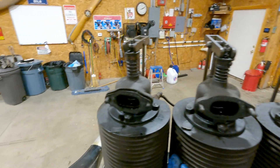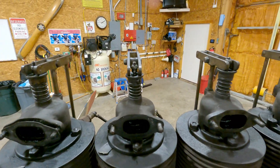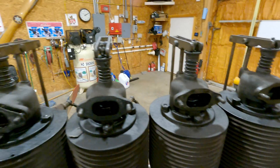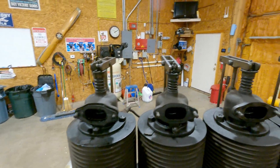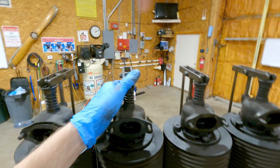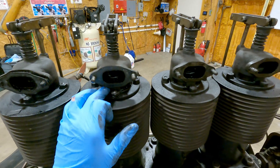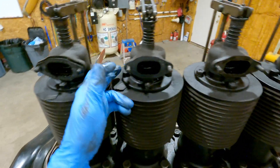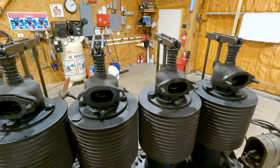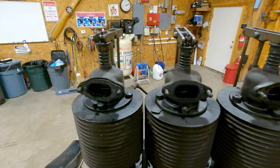As this was an early air-cooled engine, the placard actually says it was the first air-cooled aircraft engine at the time. Metallurgy was not that great, and having cool fresh fuel and air running through the intake center of the exhaust valve probably helped the exhaust valve to stop from overheating. There is no exhaust manifold — it is literally just an open space where the exhaust flows around the outside. So we'll get it off so you can have a better look.